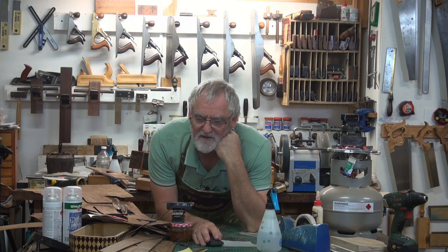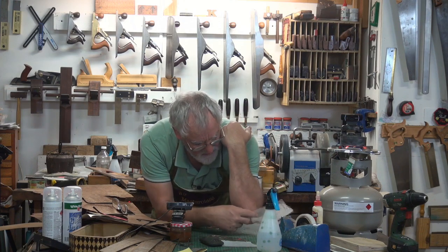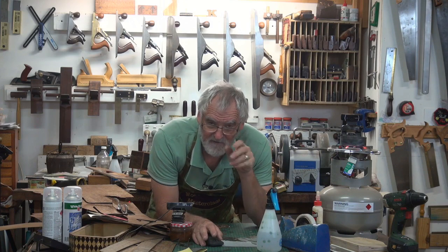Oh, yeah, no dramas, Daniel. Yeah, look, I really do like it. And they're okay. The only thing I don't like with the ceramic guides, Daniel asked me what I thought about ceramic guides on my bandsaw, is that they heat up and they do move, whereas bearings, I think, give you less friction, which is good.